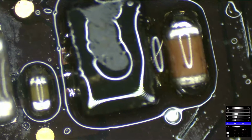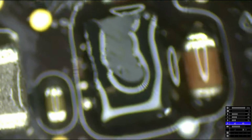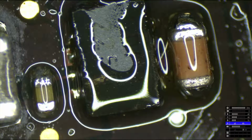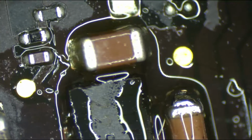But yeah, I'm not ordering this part off of Mouser. You have to understand the level of impatience that people have here. There's no way in hell I'm ordering this off of Mouser and waiting for it to get here. What I do is I have a bunch of dead boards sitting in a pile, and they're not boards that were liquid damaged, because if you're taking stuff off of liquid damaged boards to do this, very often you'll find that it doesn't work. What I try to find are these boards that have the hole in them, and you can find them on Alibaba. David Advanced Reworks sells them too.